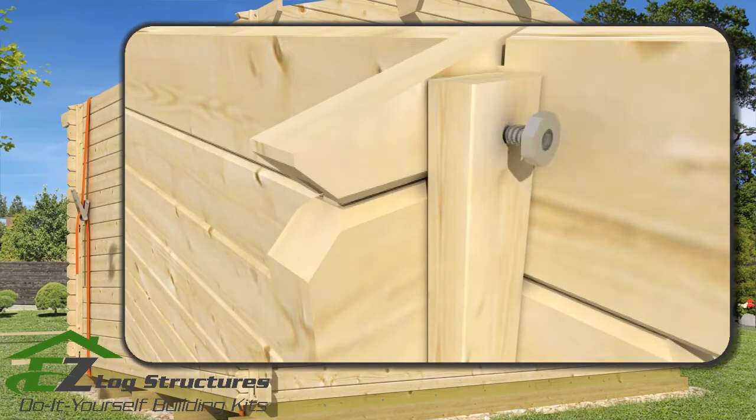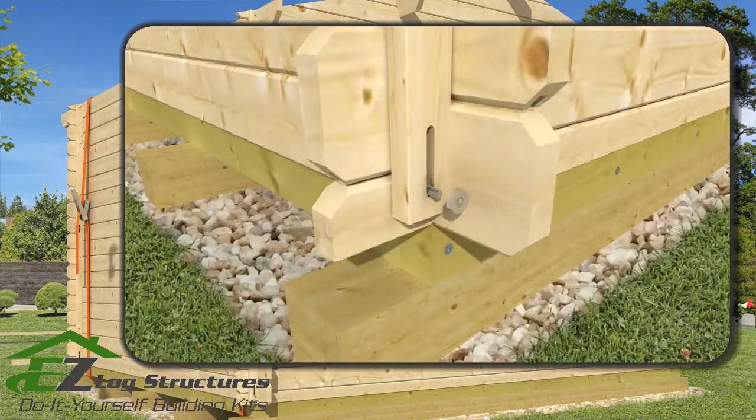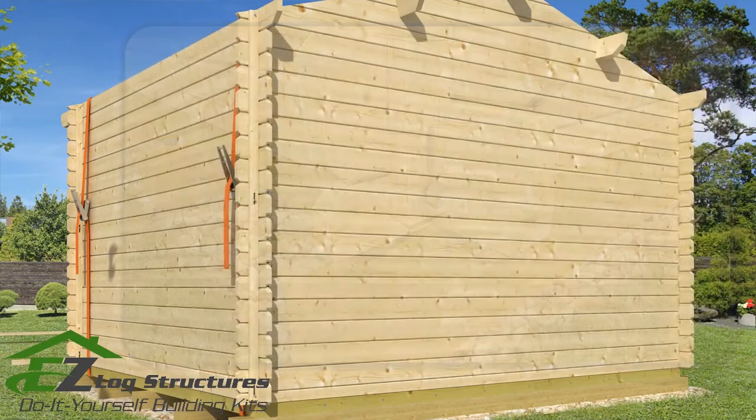Drill a hole and using the bolts provided, anchor this top bolt permanently. Drill and install the 2 lower bolts at the bottom of the slot and do not tighten permanently. These 2 should be finger tightened only. Now the wall logs will not lift when you remove the ratchet straps.